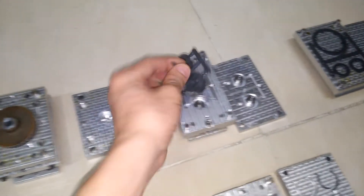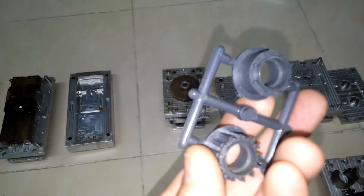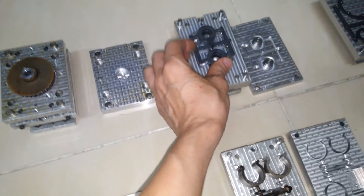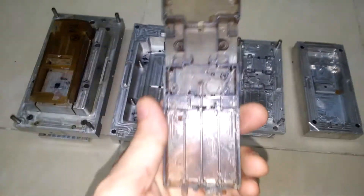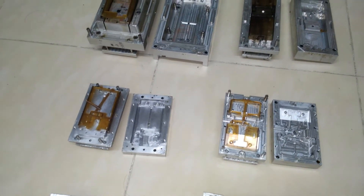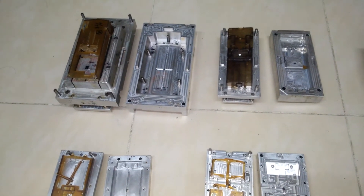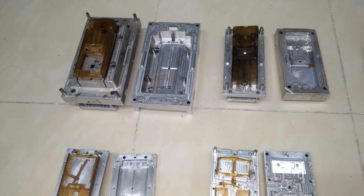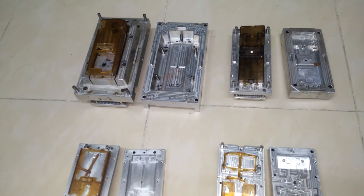There are two main plastic materials used. This one is nylon with 13% glass fill — this is an engineering plastic material. The other one is this ABS material — a transparent-type ABS. These two materials have different melt flow indexes, which describes how the material flows when it softens.